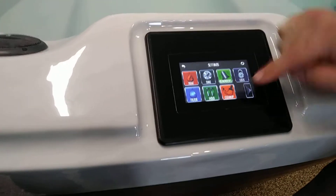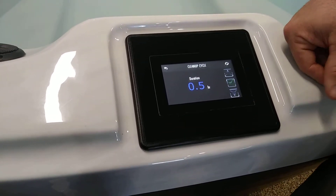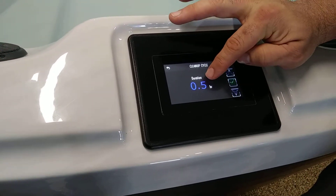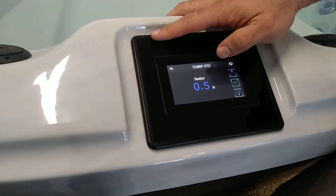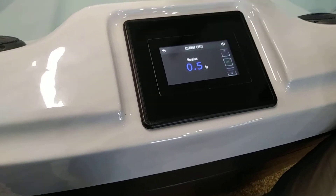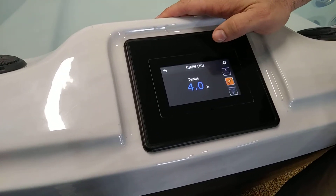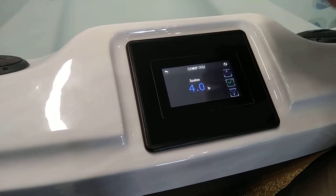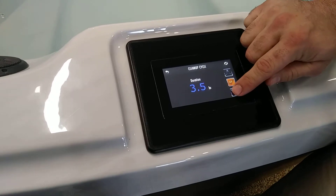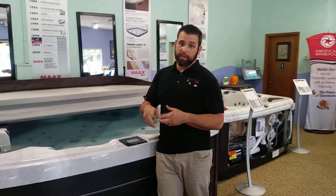And that's going to be the majority of your settings. There is this one more thing — your cleanup cycle. Whenever your spa has been running for 15 minutes it assumes you've used it. Right now this is set up for a half-hour duration for a cleanup cycle. After that 15 minutes in the spa, it'll automatically turn itself on for half an hour to make sure it gets all the body oils and everything out of the spa. If you've had friends and family in there and you really want it clean, just bring that duration up, click that green button, and you're good to go. If you have any other questions on how to make adjustments on your spa with the topside or anything else, feel free to give us a call here at Spa Kingdom or stop by the store and we'll help run you through anything you need.